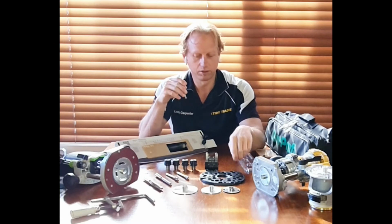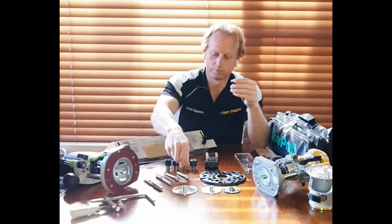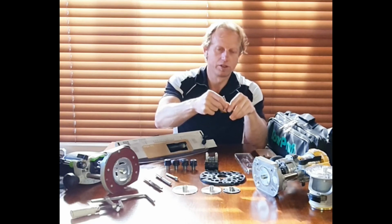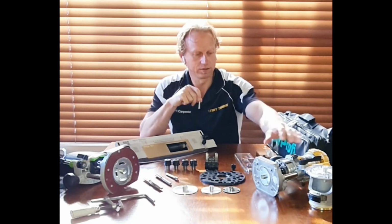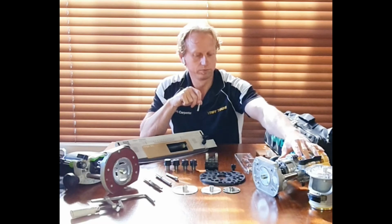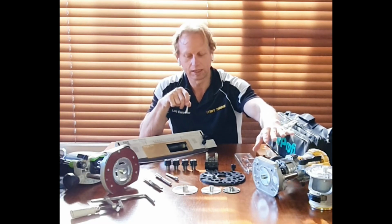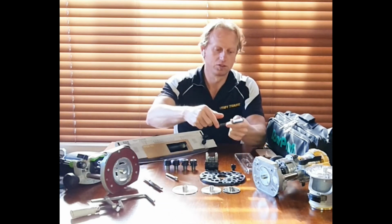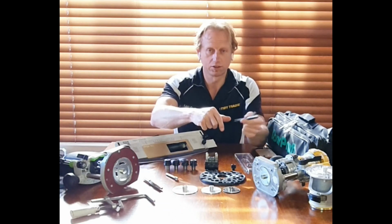They also supply the 8mm collet, so you can accept this size. And I'm pretty sure Makita would be the same as this type, the plunge base type. So you can accept the two sizes, but you can't take 12mm shafts. It's just not big enough for this model. You have to go the next size up.